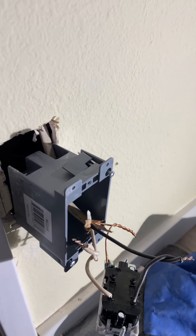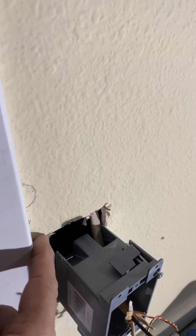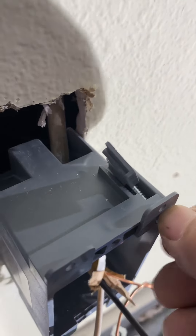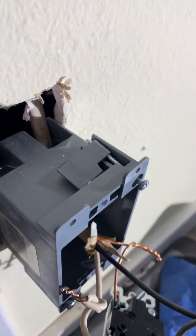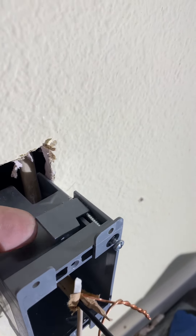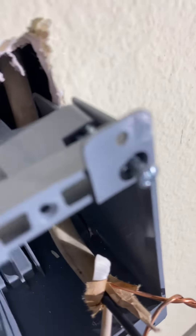Today I had to put in a box that does not bolt or nail to the stud. It's a retrofit, so what happens is these little flaps — when it goes inside and as you tighten this screw, it will come up and go behind the drywall and hold that tight. It'll hold the box tight.